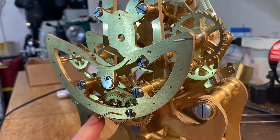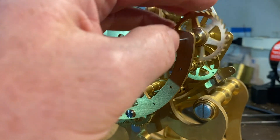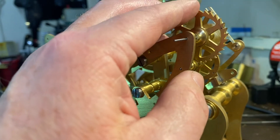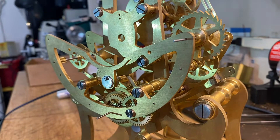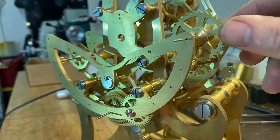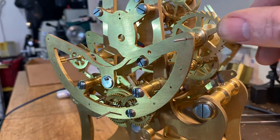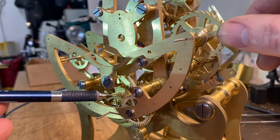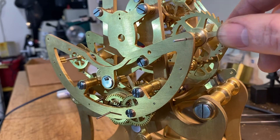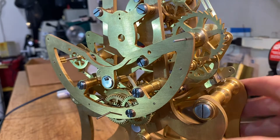Here's the month cluster. There's a cam here, and as this goes around it's gonna release this piece — this is once a month. This ratchet will travel — there are 31 teeth on this, so every 31 days it'll come around and trigger. The question is how do you get it to only go 28 days, and that's the beauty of this mechanism. Every time this releases — I'll cheat a little and do it by hand — this mechanism moves the date wheel forward. These two gears turn that one wheel, and it's going to black out the low point — and there, it would be a leap year.